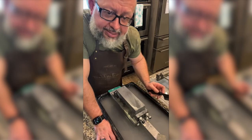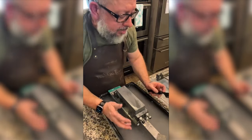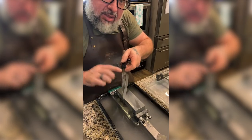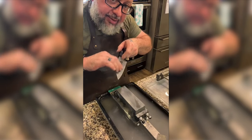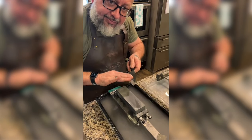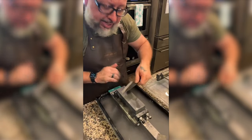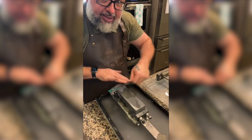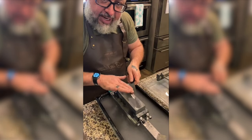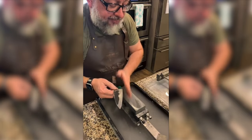practice scratch marks. One of the things I learned from Milan, and I know you know all about it, never dawned on me. I didn't think about where it's thick behind the spine, that the angle is steeper there than here. So it's been interesting to feel the knife on the stone. I've been getting used to that. I went this way at first for scratch marks to make sure I kept the angle. Then I've been doing like a 45 and trying to get them uniform, and I'm really starting to get into it. We went from the 200 to 300.